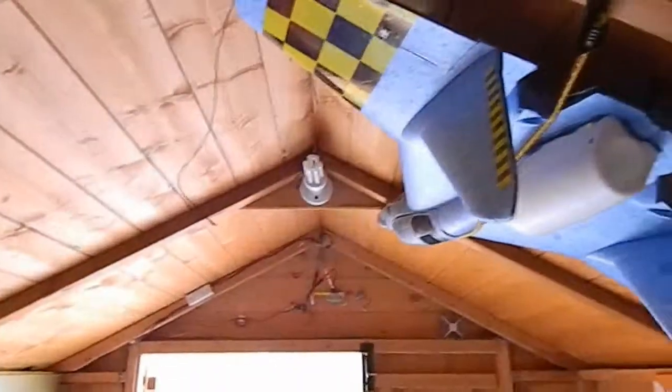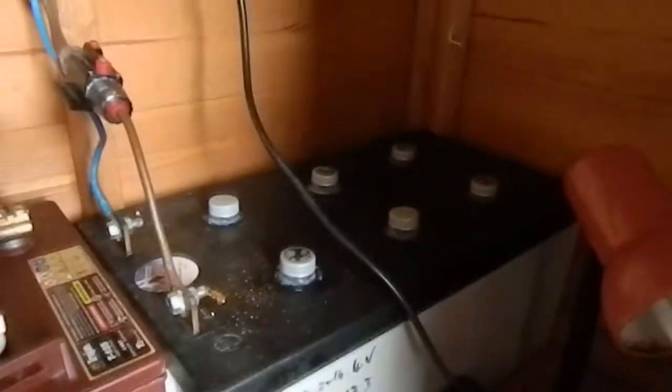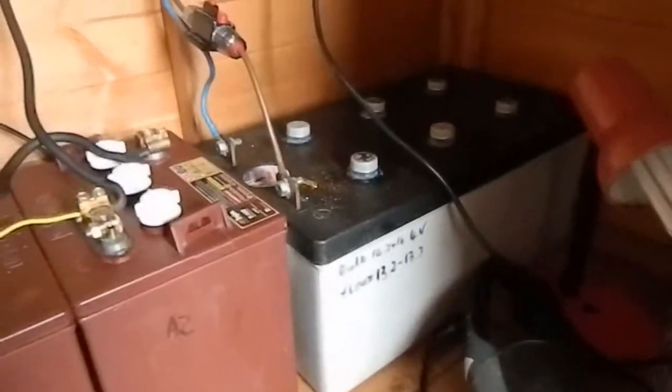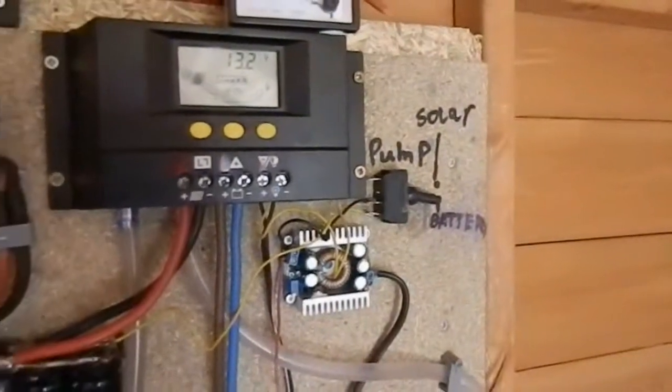my lights are all 12 volts, and so is that CCTV transmitter. So what I'm going to have to do is run them all off a single 12 volt battery, and all I have to do is charge it off the 24 volt system using the power lab here, every now and again as it discharges. Or I might have one of these buck converters connected to it all the time to float charge it.